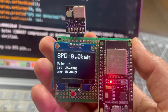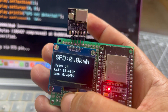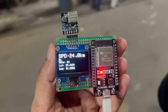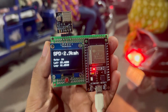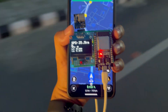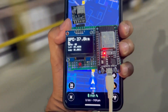This proves that our GPS speedometer is now fully functional. Now let's test the button. When I press the button connected to GPIO32, the unit instantly toggles from KMH to MPH. Pressing it again switches it back to KMH, making it flexible to use in any country. To test this in real life, I took the project outdoors. As I started moving, you can see the speed value changing on the display in real time. The faster I go, the speed updates instantly. Whether it's on a bicycle, a motorcycle, or even while walking, the readings are very accurate thanks to the GPS satellites. So with just an ESP32, a GP02 GPS module, a small OLED, and a push button, we have successfully built a portable DIY GPS speedometer that works anywhere in the world without any internet or SIM card.